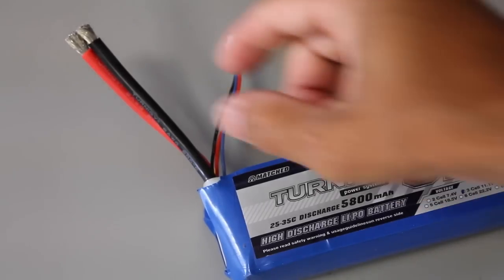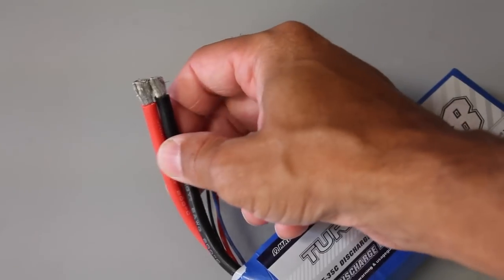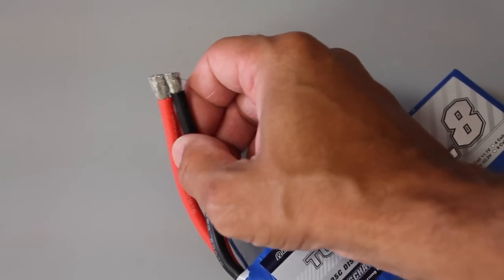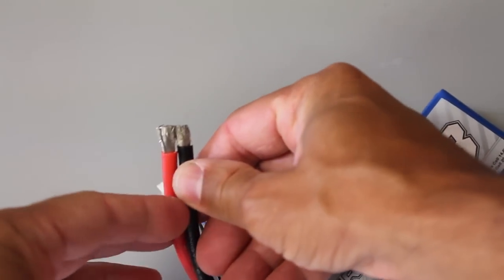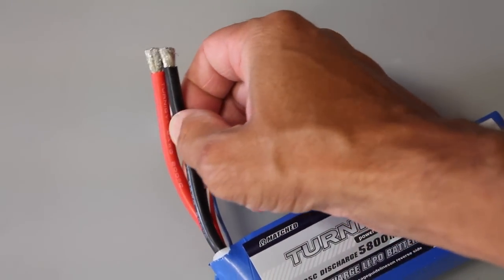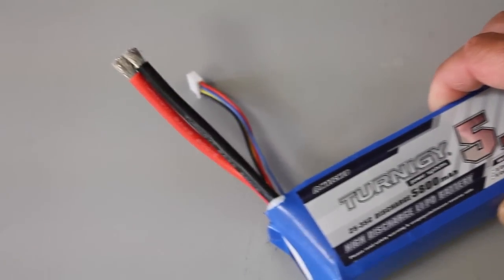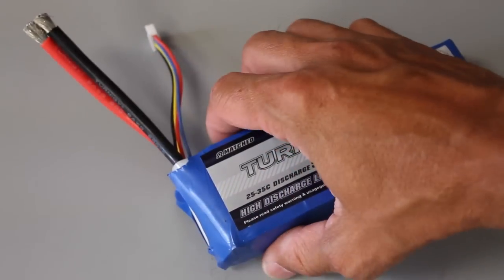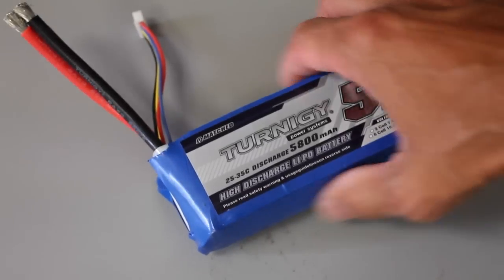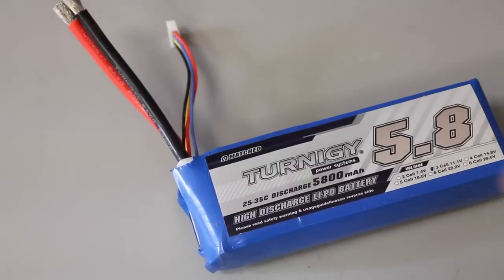After clipping the wires, you can see that I've stripped off some of the insulation. The somewhat nerve-racking part was that I just quickly tapped these two leads together and there was a little bit of a spark — it wasn't even visible, you could just hear the sound — because we had drained this to such a low voltage. I've soldered these two leads together, and before I did that I took a reading after shorting them: we were sitting at zero volts.